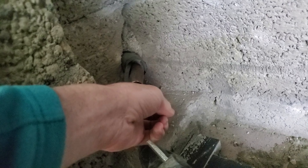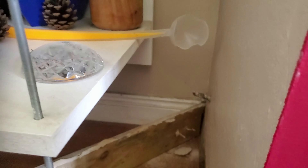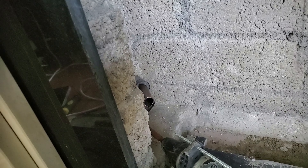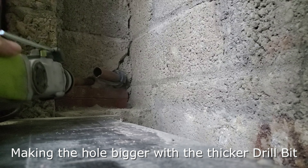There we are — what's happened is I've hit a pipe, then behind that there's something hollow, and then we're out just above the skirting board. I can run the wire behind this unit and into a socket behind there. I'll make this hole bigger now using the big bit, and then because of all the cavities in there I'll run a piece of conduit — then it's easy to pass flexes back and forward.